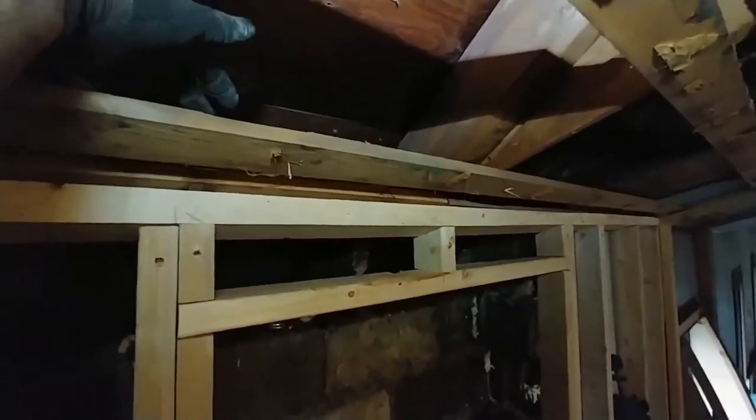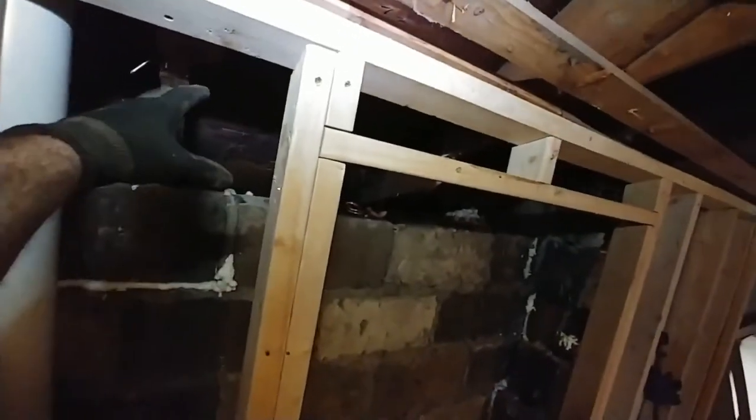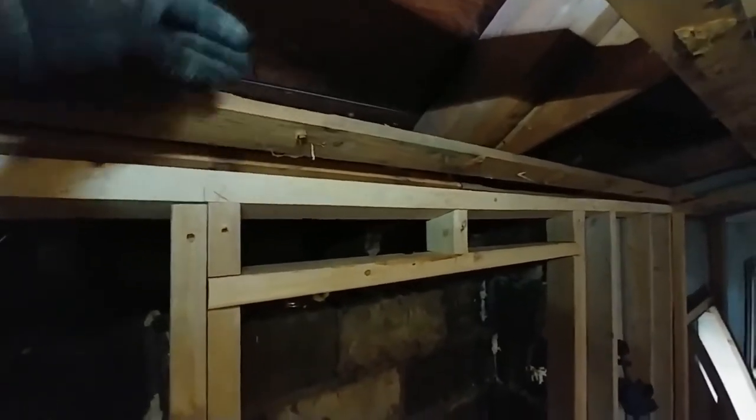And we're going to put baffle in here so that I'm going to try and seal this up so that this is full of insulation up to, you know, the plate top, basically. Then the baffle slides through behind the top of the plate and down to the soffit area here. It continues up into the bay up so high so that when you pour in loose insulation up here on top of the drywall, it doesn't fall over in the baffle and plug it up.